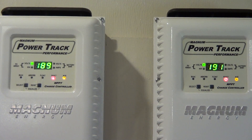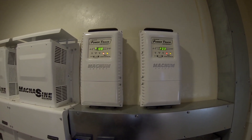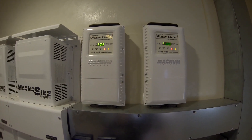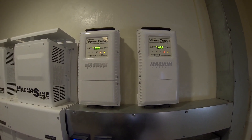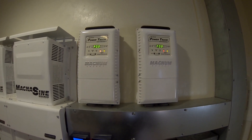There it goes. Now it's 8:50 and I've got faults on both rows, the bottom and the top. Fault F03 is an over-voltage due to cold weather. It is freezing today.